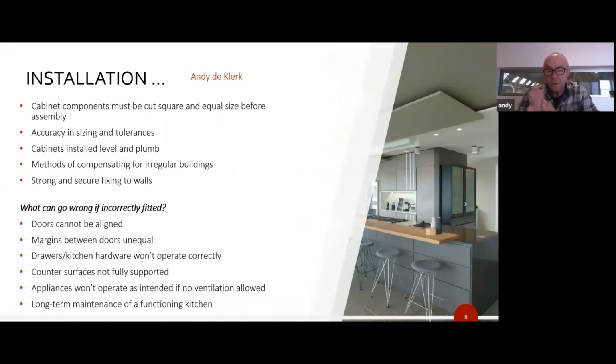Also another very important part is when you design a kitchen, you start with the appliances, and the manufacturers of the appliances give great detail and dimensions and requirements for ventilation and requirements for power and water and whatever, and you have to listen to those. We always start any kitchen design with the appliances that have been chosen, and we build the cabinets exactly like the manufacturer recommends. And almost all of the integrated appliances require quite specific ventilation, and the cabinetry has to be designed for that.